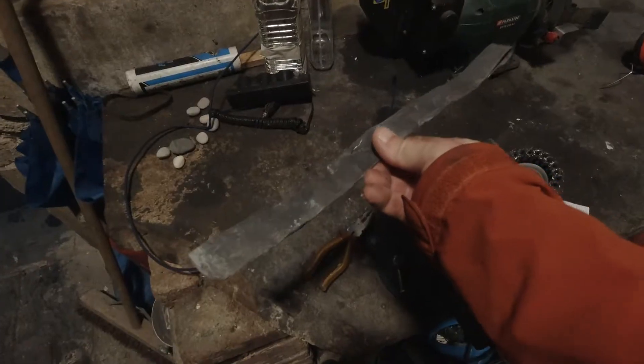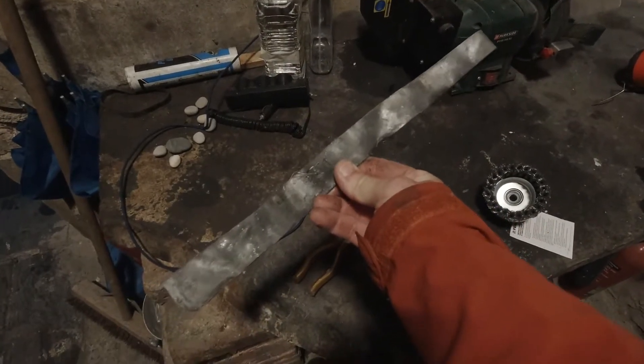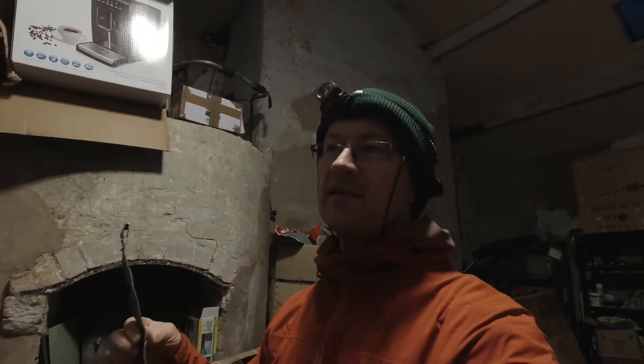Anyway, let me go get the pieces to fix this one. So this is the solution to getting the slate back in place. We can't put nails back in because the nails go at the top of the slate, and you can't hammer new nails in without taking off all the slates that are above the current one — so you've got to leave all the current ones alone.